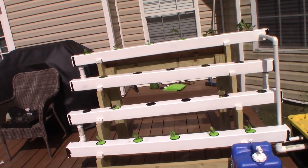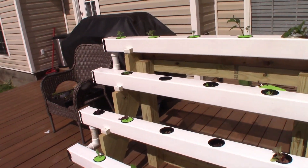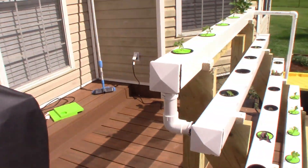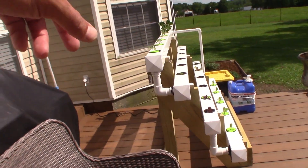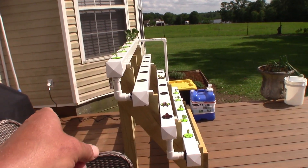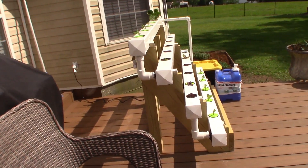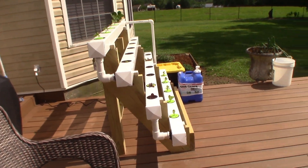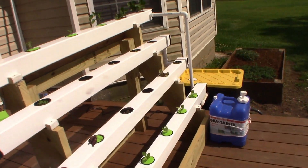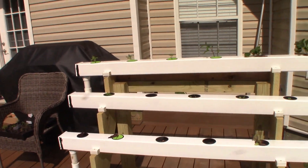So for starters, instead of building my own rack, I went to Home Depot and bought stair risers. I put them so that they stand high — they would usually be rotated 90 degrees, but I made it so it's got some height. Then I used some 4x4s in the back, leveled it in the front, and put some stringers across for bracing. That was a really easy project as far as getting the rack ready.